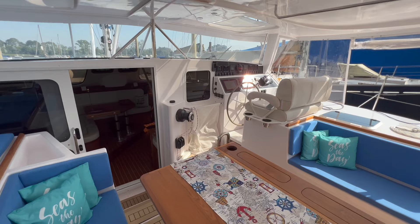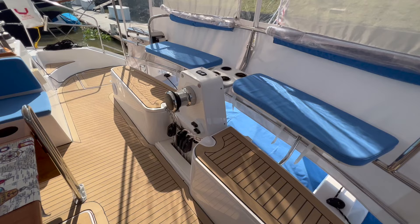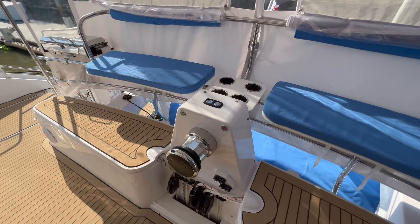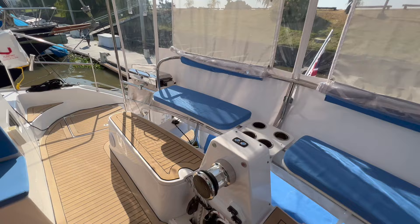We have two manual winches and two electrical winches as well — that one for the main sheet. In fact we have two main sheets and the vang. On the aft pedestal we have an electric winch to control a halyard and to do for instance the outhaul of the main sail. That's a Selden system — a synchronized system, so whatever we do here is synchronized with the small motor in the mast to outhaul the main.